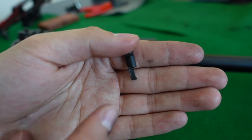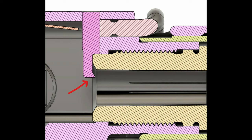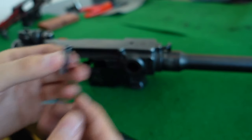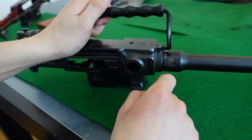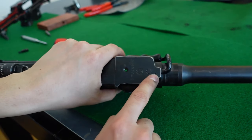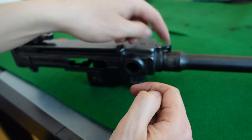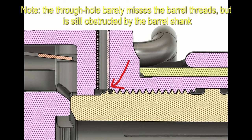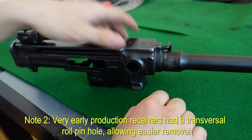The reason is that the loaded chamber indicator has a beak-like extension that interfaces directly on the chamfer in the barrel at the breech end, therefore it is positively retained and the only way to remove it is to unscrew the barrel. The same goes for the carry handle — there's a roll pin that retains it in a groove, and the through hole actually goes into the barrel threads, as you can see on the cutaway model. So both parts can only be removed with the barrel off.